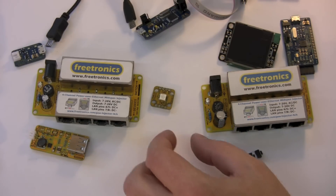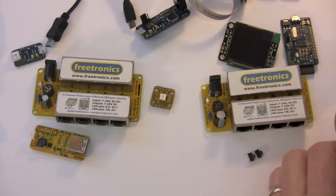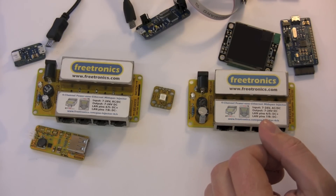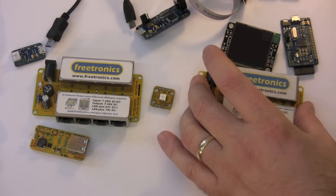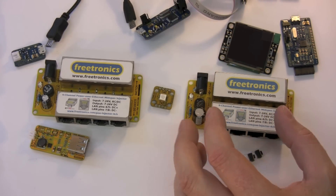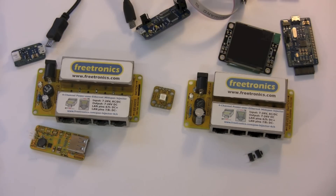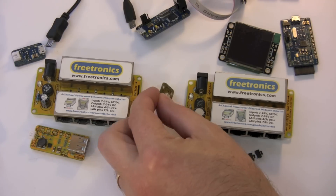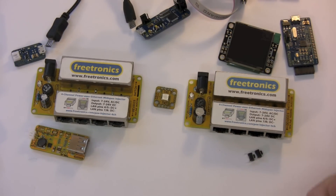The other thing that's a really good hint is to print out the PCB and physically put the parts in place. It may sound kind of childish, but it's a great way to catch problems before you get too far down the track. Typically what happens is rather than hand-assemble a circuit, we design the shield, the Arduino-compatible board, or module on the computer — laid out in KiCad or Eagle — and get the design as good as we possibly can, checking against physical printouts until we're very confident it's ready to go.